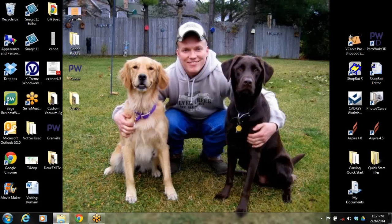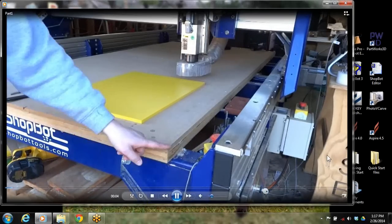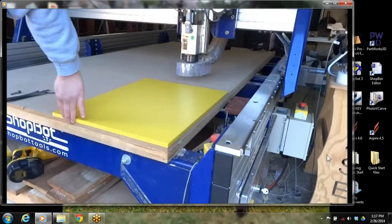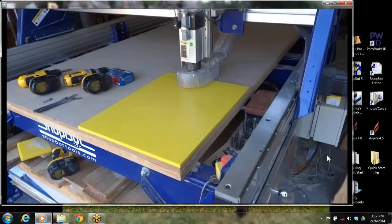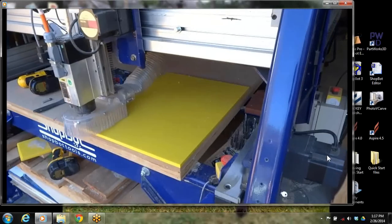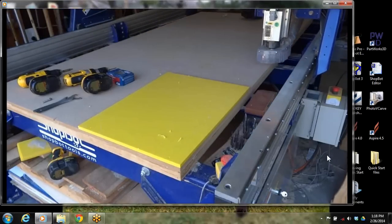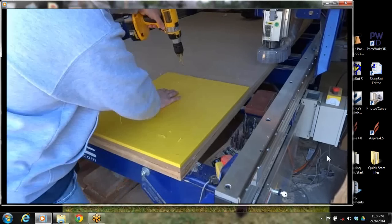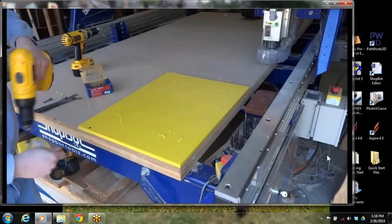The first thing I did was eyeball zero — that's fine for the first time you cut your jig, because you're going to put a set of indexing pins in that you'll always line back up with. Here I'm running the hole down into an 18-by-24-inch piece of material — it won't move if I drill just 50 thousandths deep. Then I pre-drill and run the hole down separately so I can move the gantry out of the way, run my screws in, and then go back to running the file.